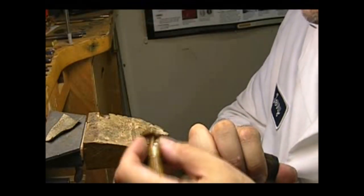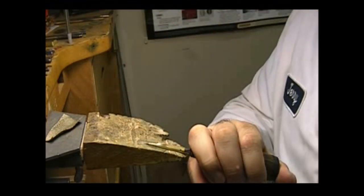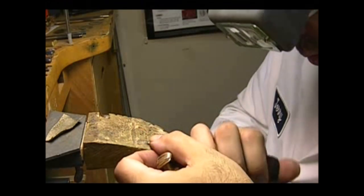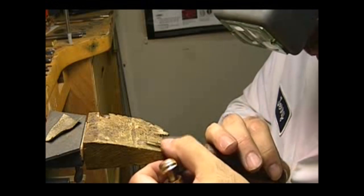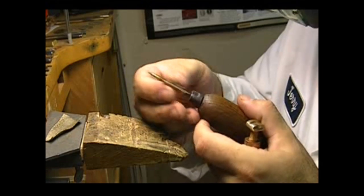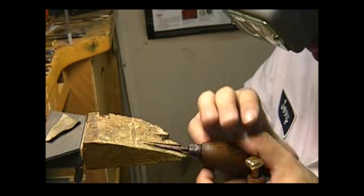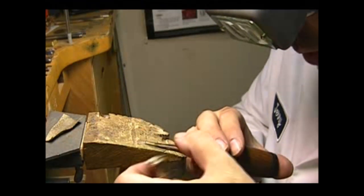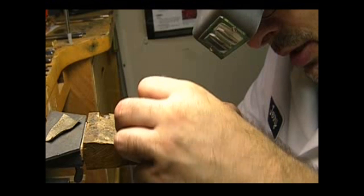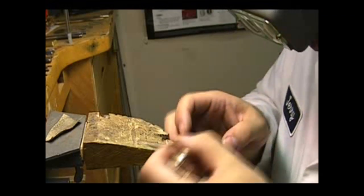Take your burnishing tool and use whichever side works best — bend it over. I'm going to use some magnification because my eyesight is getting worse. You want to bend this down, but don't shove it all the way down the mandrel. Keep it up a little bit so it's loose — you need room for the metal to bend down to the mandrel and spring back, because it's going to develop a little work hardening.